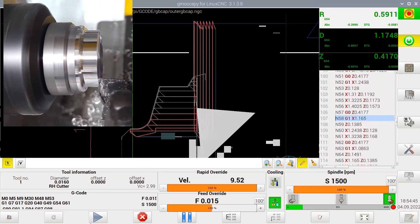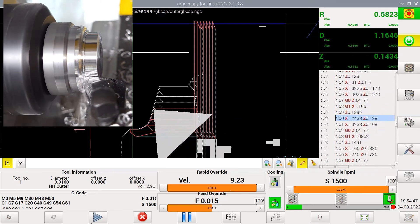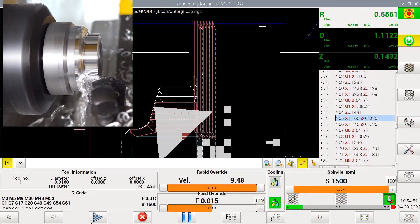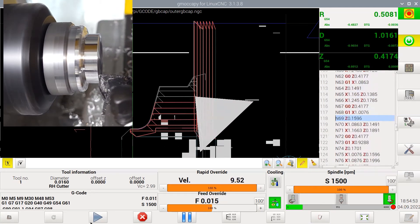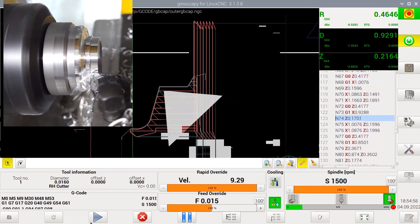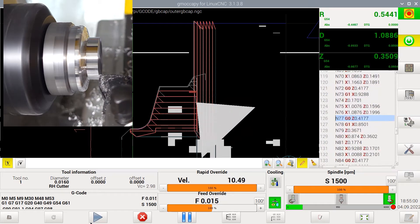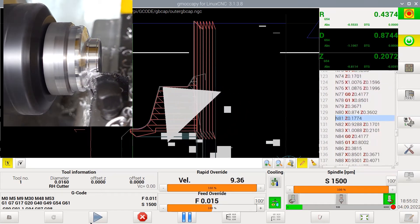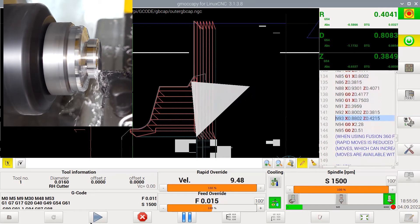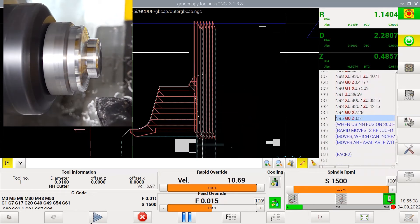The control system here is a Raspberry Pi 400 running the real-time operating system for LinuxCNC. Doing screen capture on that is a bit tricky — we're using x11vnc over Wi-Fi back to my PC, which is then using TightVNC to view it, and then using Zoom to do the screen capture. This means it gets a bit pixelated.